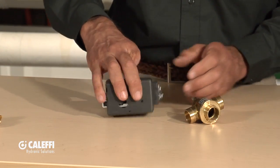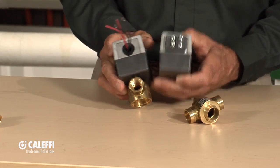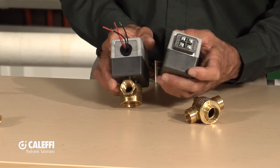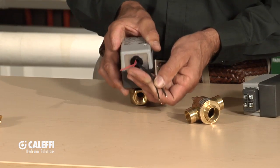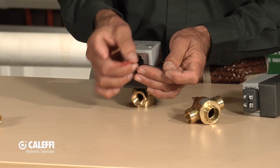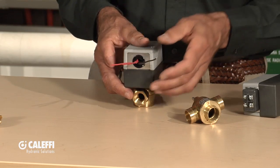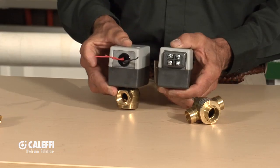We offer this as a terminal or as a lead. Some guys prefer to have the terminals if you're going to wire this to a zone relay box — you get the terminal strips and can put whatever length lead you need on there. Other guys prefer it to come with the leads. Notice this is a four-lead actuator: two of these are going to drive the motor open, and the other two are the end switch. The end switch can be used to trigger your boiler, turn on a pump, or turn on a relay in a control box. A four-wire configuration is available with the terminal strip or with the leads.